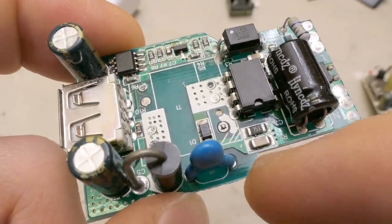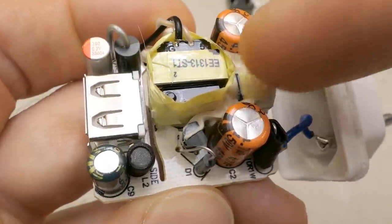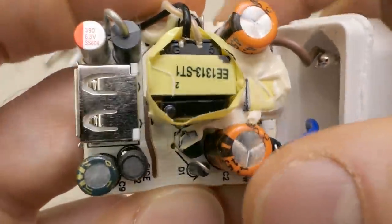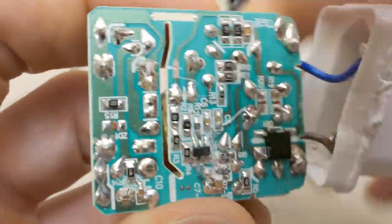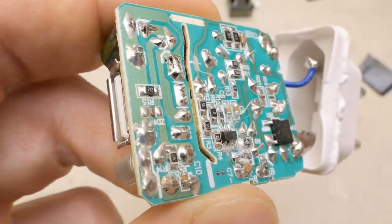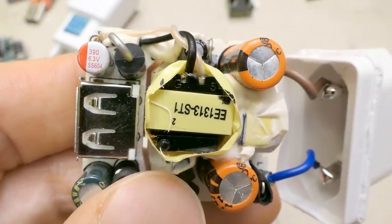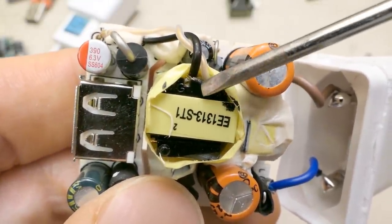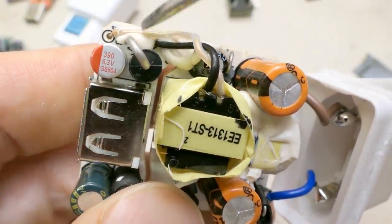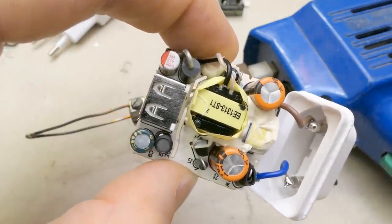Maybe the transformer has an interference shield between the primary and the secondary, so the capacitor is not needed — this is another way of eliminating common-mode interference at the output. The cheaper ones probably use a capacitor because it makes construction of the transformer easier. Now let's take a look inside the transformer. With no capacitor between the primary and secondary side, no optocoupler, and good insulation on the board, the electrical safety depends more or less just on the transformer. Unlike in the other ones, the secondary of the transformer doesn't go to pins — it goes to wires that go into the board. So let's desolder the transformer and do an autopsy.